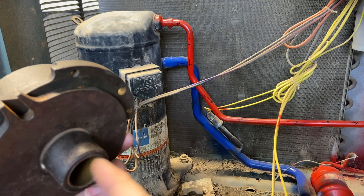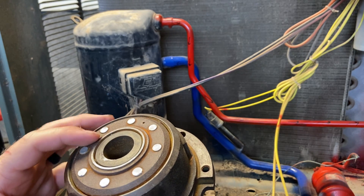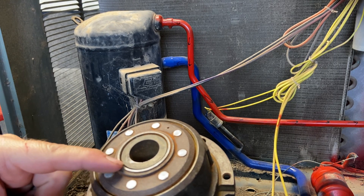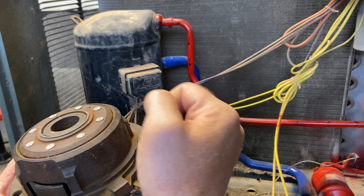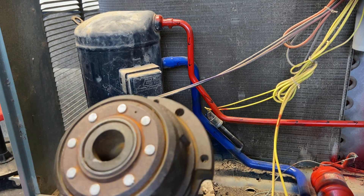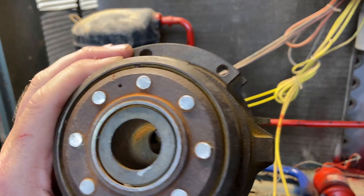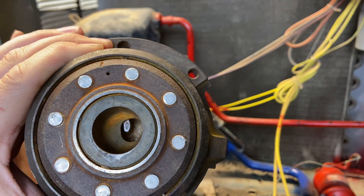It takes three rotations of the motor to make one full pump action. What makes it so efficient is there's another one just starting and another one halfway in the middle. And because we never have to change direction like a reciprocating back and forth, we're always moving forward — so it's very, very efficient for the motor. From the very top side you can see how it's squeezing and discharging at the top.